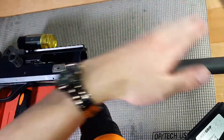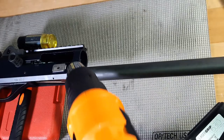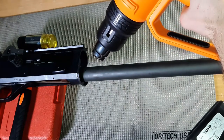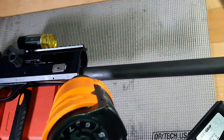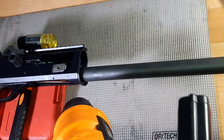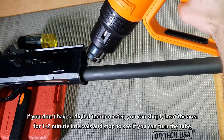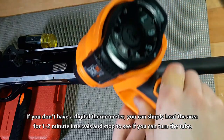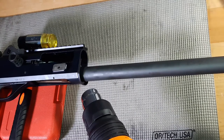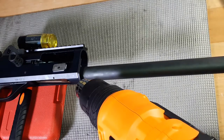You don't want to heat the receiver, you don't want to heat the barrel — you want to heat right where they meet each other, not just one spot but all around. It would also be really helpful if you have a digital thermometer so you can see the exact temperature. Whatever you do, don't go above 400 degrees Fahrenheit. I personally don't want to go above 300, but definitely don't get anywhere close to 400.